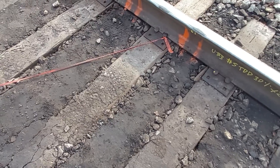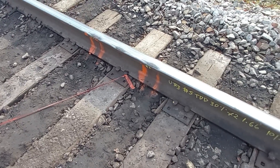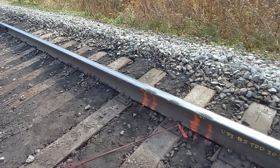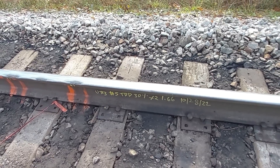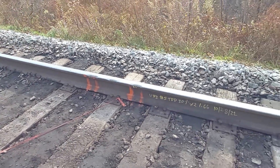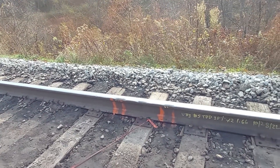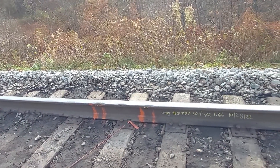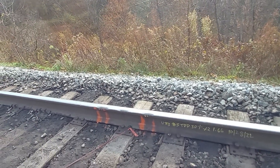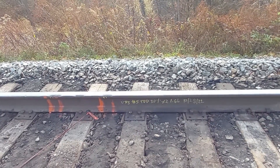I wasn't with them - I actually took a day off Friday and didn't know they were coming, or I would have worked. Saturday, yesterday, we did change that rail down there at milepost 4. I was going to show you that, but my high rail truck is currently in the shop so I have no hydraulics. Frontier did send us a grapple truck out here and we got the rail, but it didn't have any hydraulics. So all the spikes on that rail, we had to pull by hand and drive them back in by hand. Three of us, and we did pretty good - 48 minutes to replace that section of rail. It was in tangent track, everything went really well. What we did not do is put the anchors on - that's a project for this week. This rail is definitely getting replaced next.